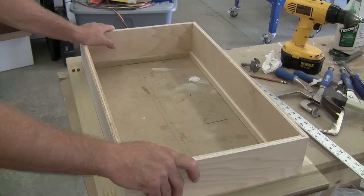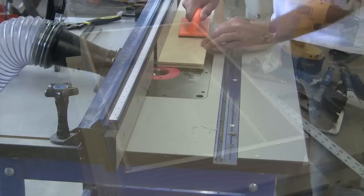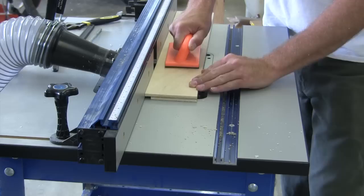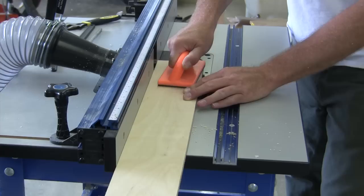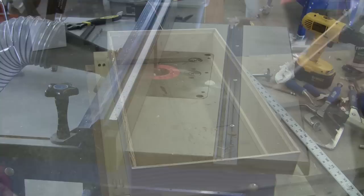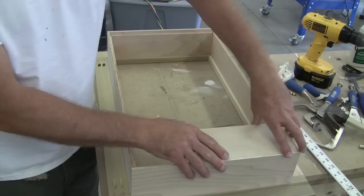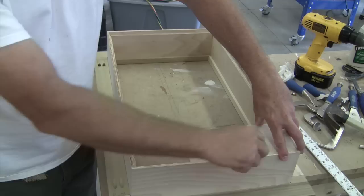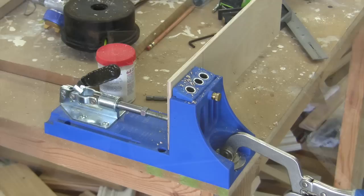I think it'll work out fine. If it turns out to be a disaster, I'll just start over and go to Lowe's and do it the way I'm used to doing it. So let's see what happens. Check it out — now that we have our rabbet cut in the back, when we cut out the backing it'll just lay right into place and be flush. We'll hit it with some nails on each side and glue it in. This, my friends, is Redneck Engineering right here, and I think it's going to work out really good.